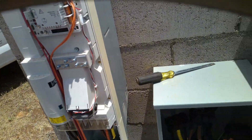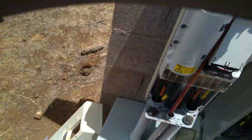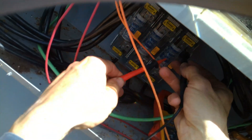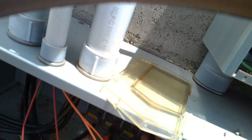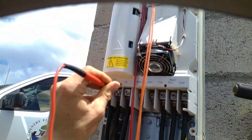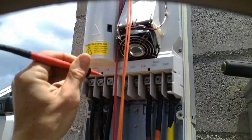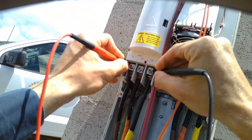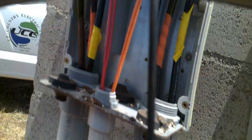It's been a while since this thing has run. Let me turn off the power before I go any deeper - just to verify. Good, we're off. I'll check continuity to ground - that's all good. Checking phase to phase: 62,000 ohms, 63,000 ohms, 63,000 ohms.